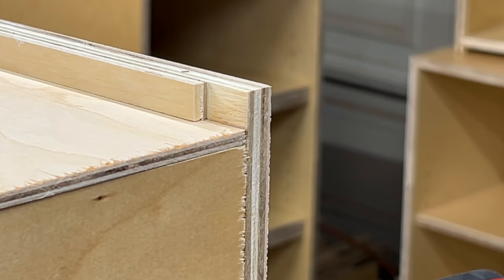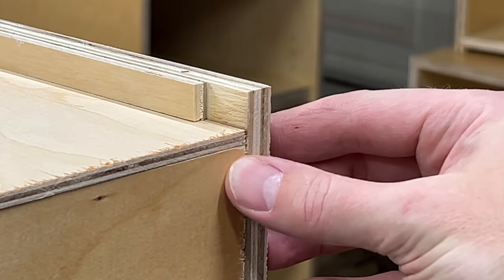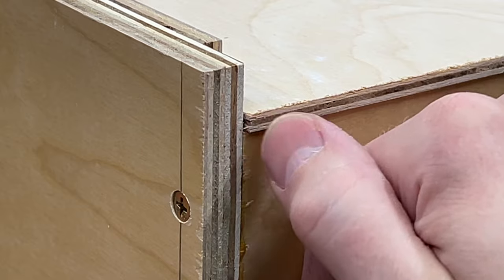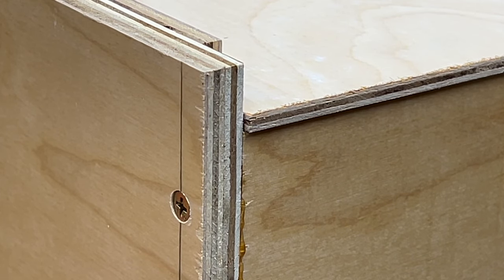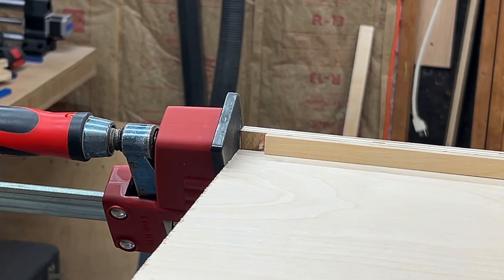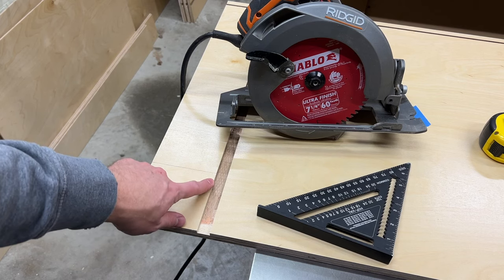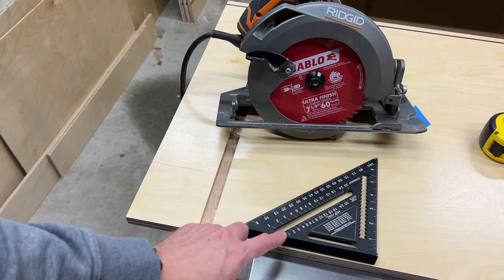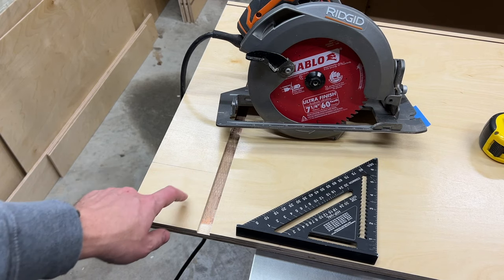Even after all the clamping and using the clamping squares, my cabinet is not quite square — this end is flush on the back panel but the other side is sticking out quite a bit, probably a sixteenth or so. So I'm going to put some clamps on this back panel on the top and squeeze it square before I screw it down. With these clamps in place the back panel is completely squared up and pulls the cabinet back into square. The lower cabinets need a toe kick in the front — I'm going to use my circular saw guided with a square to cut right along the bottom edge of this dado and then across here to knock out that corner.